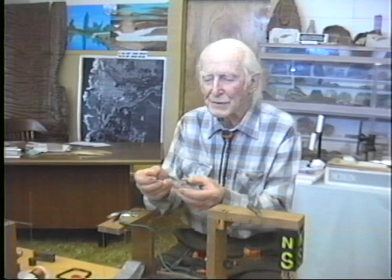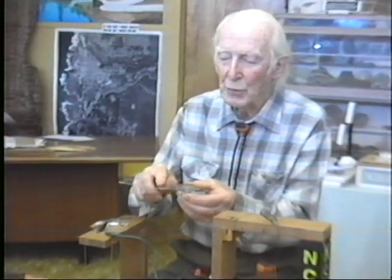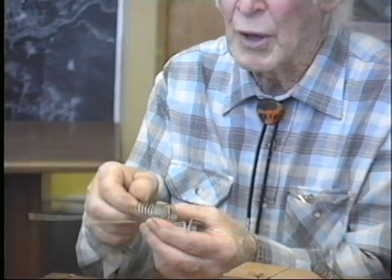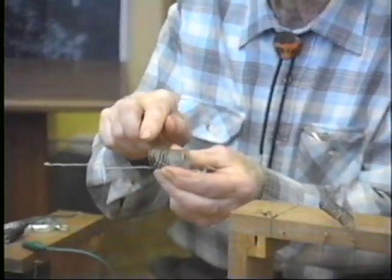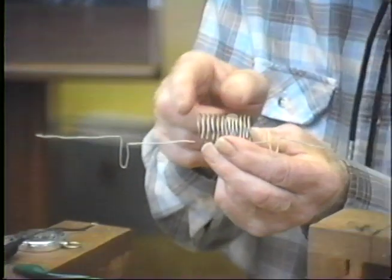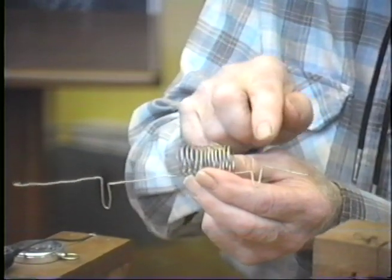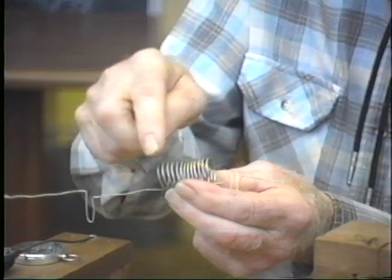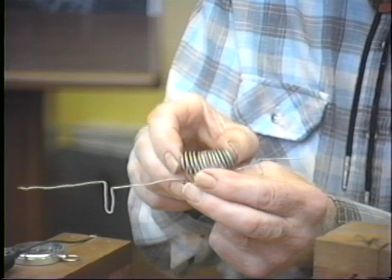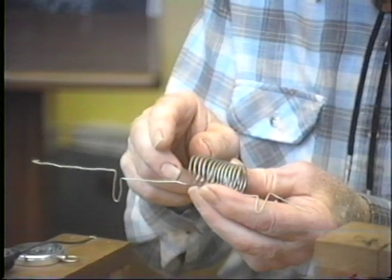Let's review what's taking place. I have a coil here and a piece of conductor. If I run a current through here, I get a circular field around that conductor. If I wind that conductor up into a coil, I still have a circular field around these individual wires, but they all link together and make a stronger magnetic field. The magnetic field comes on the outside and back through the center of this coil, around the outside and back through the center, all the way around — not just on the top. That would then be an electromagnet. The important part is that they link together and make a stronger magnetic field.